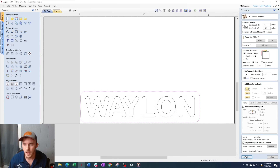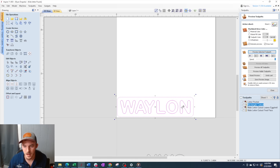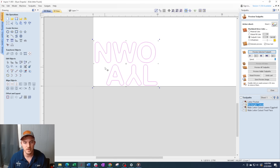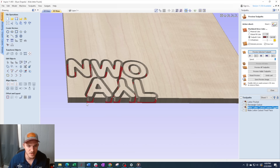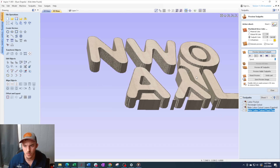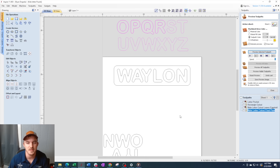After that you're going to cut out the rectangle — I'm going at 100 inches a minute on that quarter inch down cut bit, going in four passes, and I'm holding that piece down with some double sided tape. The female part is cut out of three quarter inch maple, and I'm going to cut out the male part from three quarter inch walnut to give it a nice two-tone look. I leave a small space for a clamp and put double sided tape on the back. The toolpath leaves a slight eggshell at the bottom so those pieces don't jerk around after that last pass — you come and take that out and your letters ideally will not move.